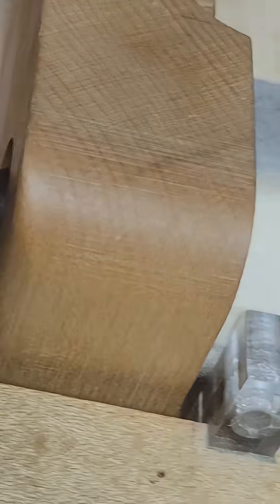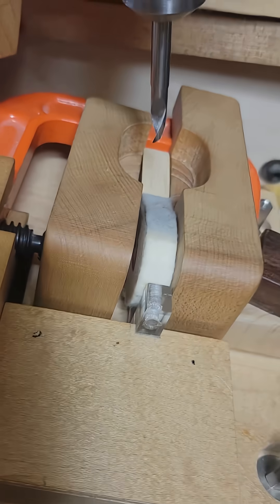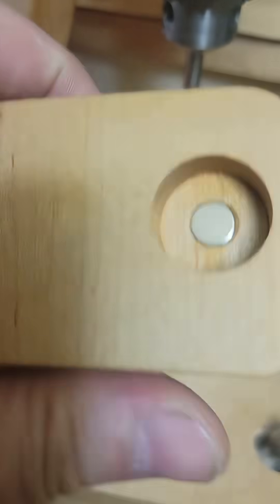For this demonstration, I used a rare Renner hammer from nearly 50 years ago — new old stock. As you can see, it's a B-type, or Bechstein style, with a distinctive shape. Because of that, I reversed the usual orientation and drilled from the backcheck side.